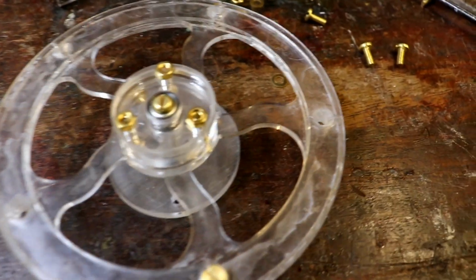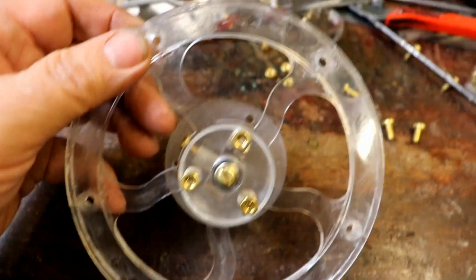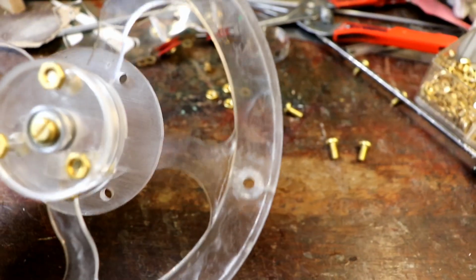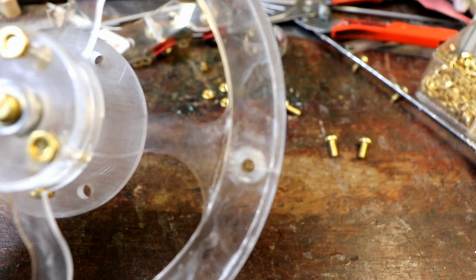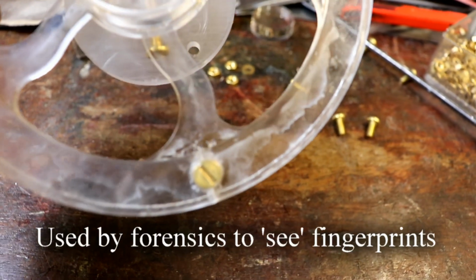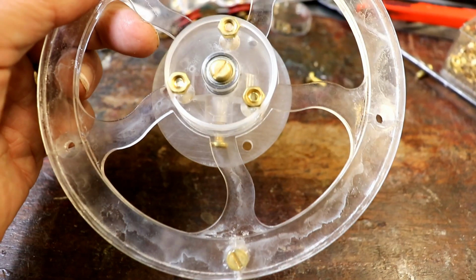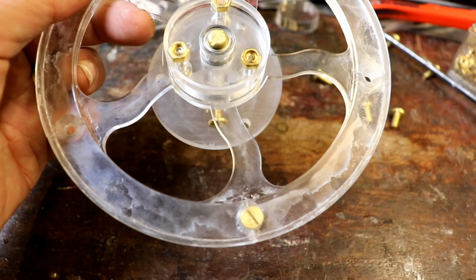Having applied copious amounts of super glue to the outside rims on both the front and the back, which looks an absolute shambles, the super glue, if it finds any grease anywhere, any remotest hint of grease from a fingerprint or something, goes white, produces white deposits. It looks a right old shambles, but what I'm hoping is that once I spray it, it'll cover everything up.